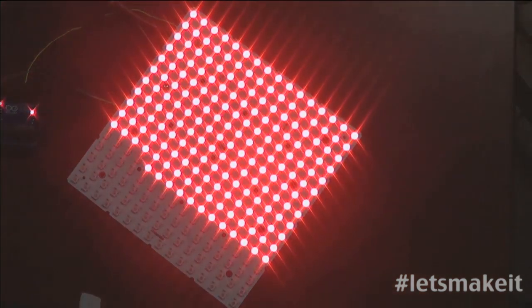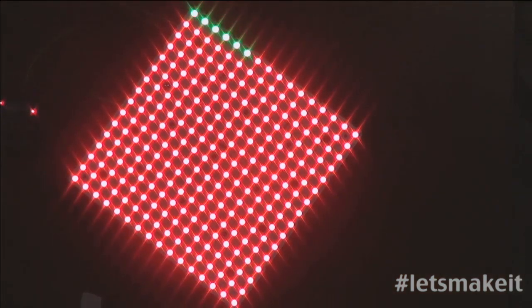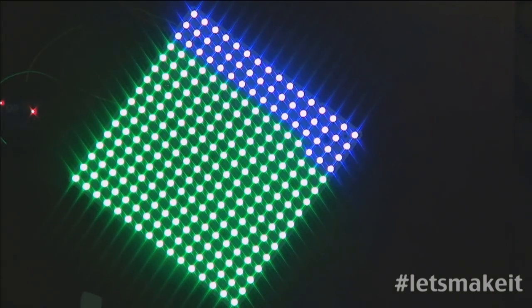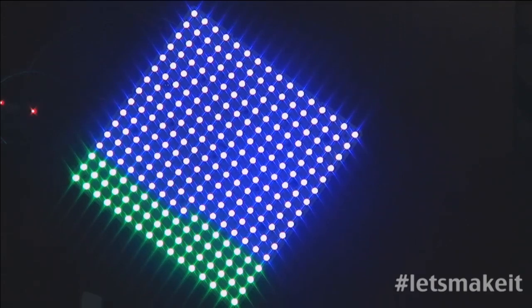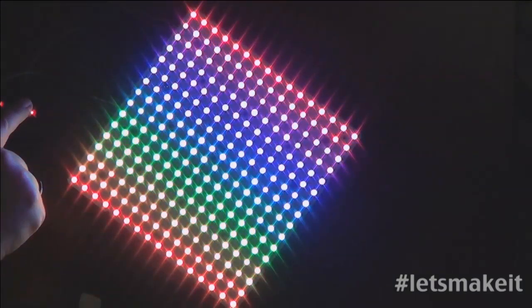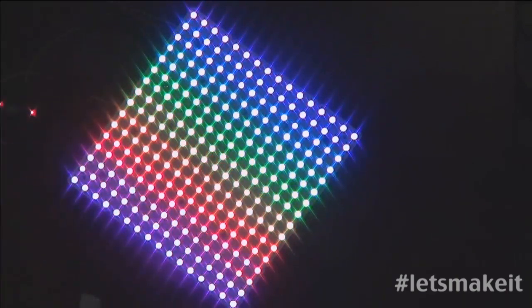You're going to see a bunch of patterns coming around. The more things that come out, the brighter it gets. But you can see each pixel can be individually addressed. This is that 2812 chip that basically has a mini shift register on each LED, so you can basically do RGB using one wire. You can't see it now, but there's one wire right here that is the control, and this other wire is just the ground for reference.